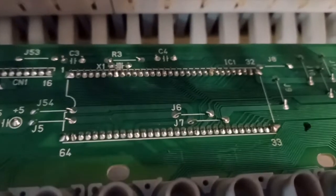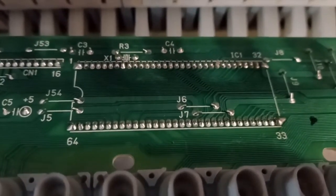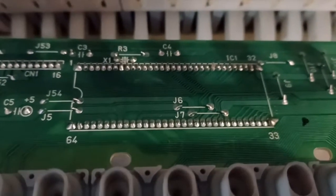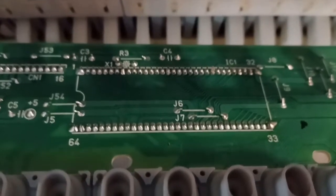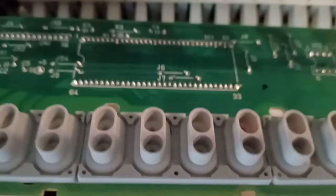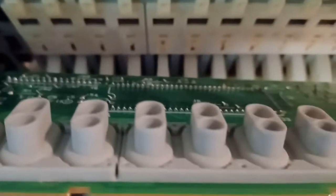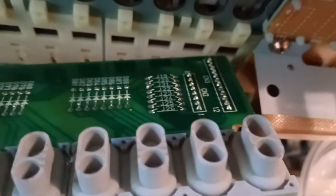All right, that is the gate array connection. Can't focus it too well. There we go, getting better now. Okay, these are the solder joints. So I'll get a continuity tester and see if I could tell if there's any bad connections. All right, that's the next step here. But look at that, the hammers of the piano have little things that touch these and hit the switches. So I'm pretty sure the switches are okay because we're talking the last four up here. And I can't see anything obviously wrong here.